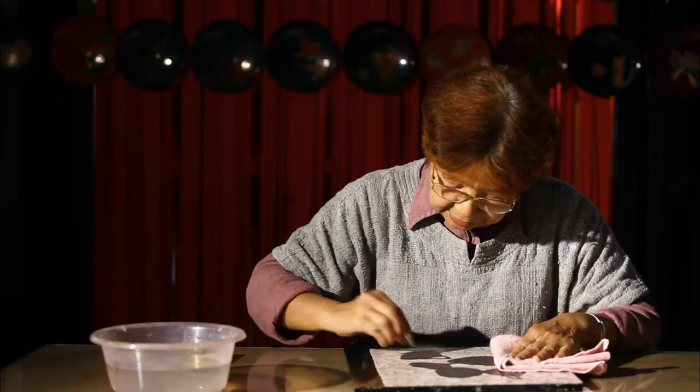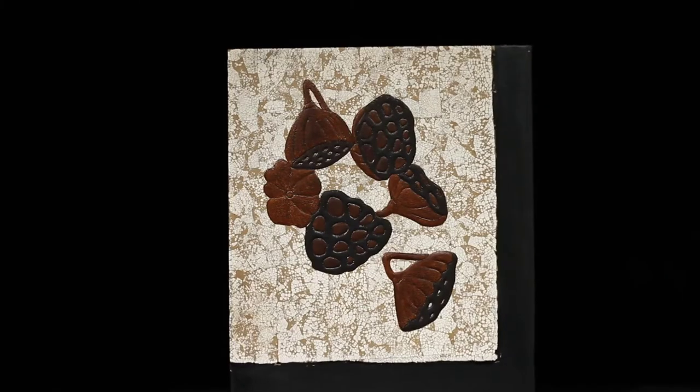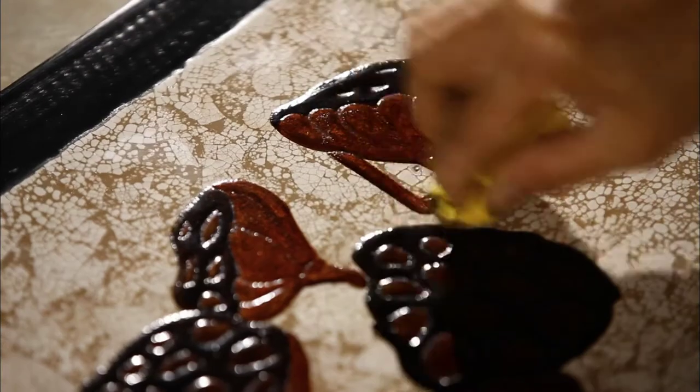Generally, 4 layers of covering lacquer should be applied. Another layer can only be applied when a previous layer has dried and been ground. After being ground, the surface is fine and smooth but lacks luster, so it needs to be polished to produce a more mellow luster.